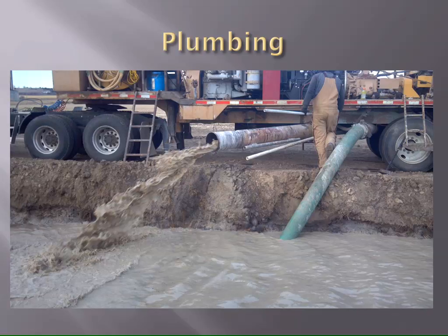That hole is 30-inch, 16-inch casing, gravel-packed — I think that well had 76 cubic yards of gravel go in it. Regarding internal versus external air: with internal air you don't have friction through there, and rocks don't get hung up the same way. There are advantages to external air too, though — especially when you get into some bigger rocks with a drag bit.